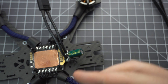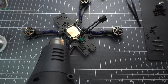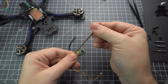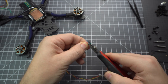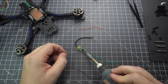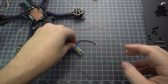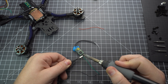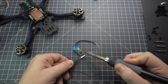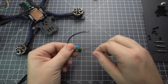That completes the motors and the 4-in-1 ESC. Next we'll just melt the heat shrink to secure the wires and we can move on to the receiver. Here I'm using the FrSky XM Plus, which is a fairly economical and small receiver. We want to solder the SBUS, 5V, and ground wires to the XM Plus. It's really handy to have some blue tack to hold it in place, and it's usually a good idea to give your wires a little tug at the end to make sure they've got a solid connection to the board.